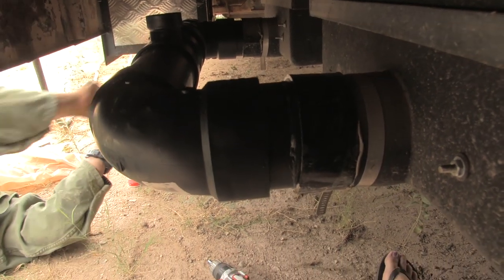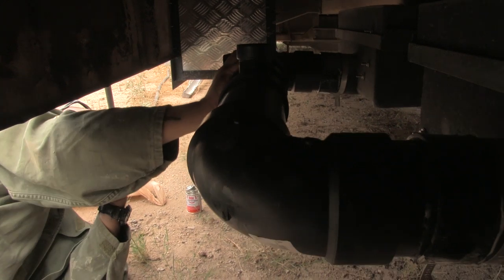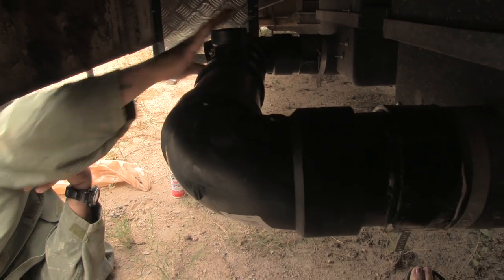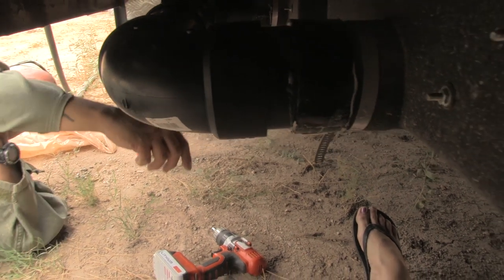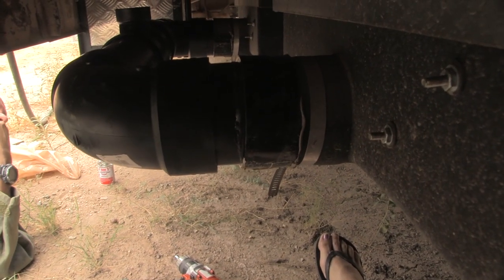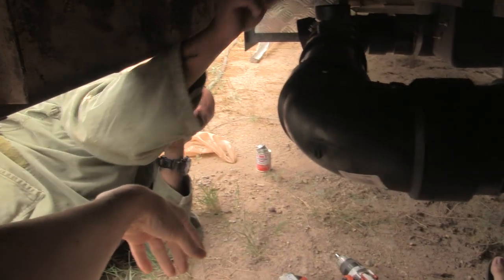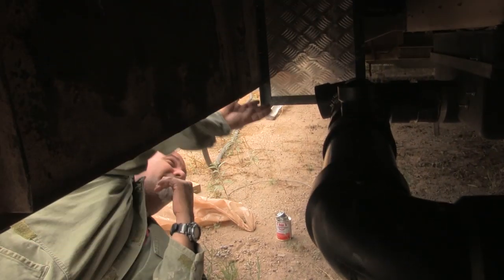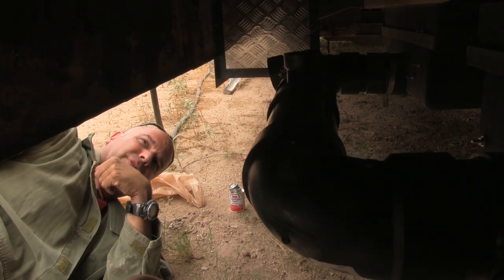So this is the one that we had to make sure that we adjust it just right, because this is just being held up by the flanges there, and we really don't want that much pressure on that. So is this going to get us like a support strap? Yes. Okay. We're going to use some plumbing strap here, which probably would be enough, but we might do another one. We'll see.